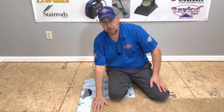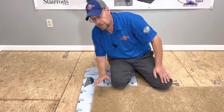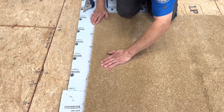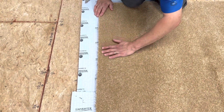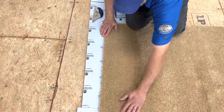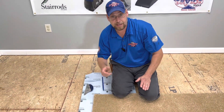This is the piece of carpet we're going to be seaming. You always want to check which way the nap is laying. You can check that by simply rubbing the carpet — one way it looks light, the other way it looks dark. It's just like a piece of velvet: one way the pile is laying down, one way the pile is standing up. You always want to cut your carpet in the direction that the pile is laying down.